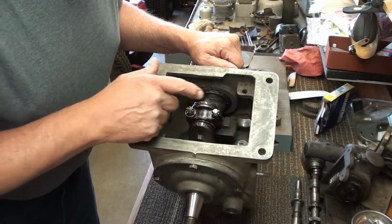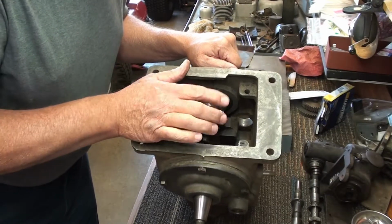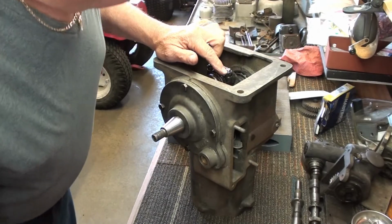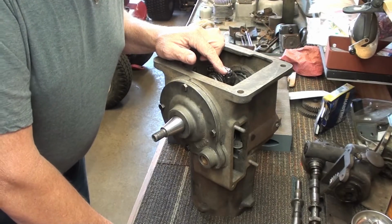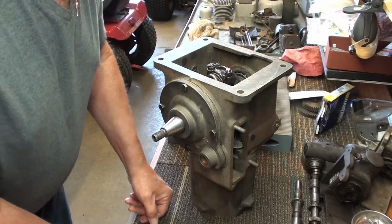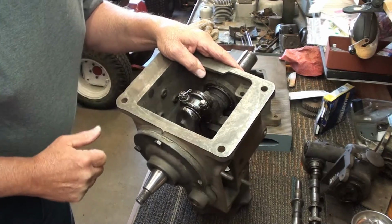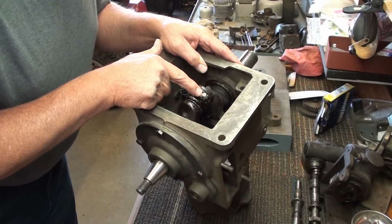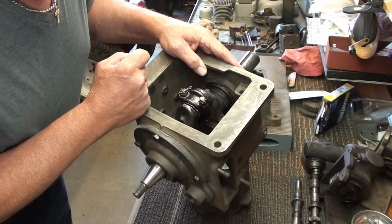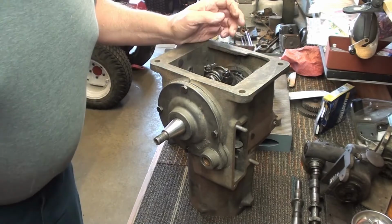I've got this one done. I've got to get this one. What I've got to do is get a washer and put it underneath that nut and bring it up to where the castellations cover the hole here, and that'll make the cotter pin hold the nut. The number of washers or shims I use underneath the nut determines the position of the castle, so I can get the pin in there in the correct position without having the nut too tight or too loose.